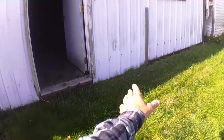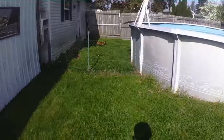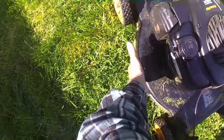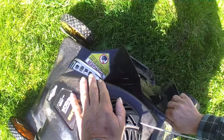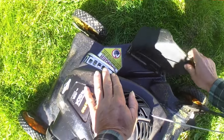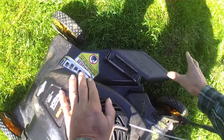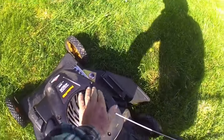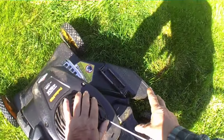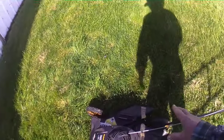Okay, now we're going to start the mower. Always start at the far edge, making one trip throwing the grass inward. This side of the mower is smooth, and this other side has the discharge flap. A lot of people like to put the flap up so the grass flies out better. This morning the grass is wet, so that might be the thing to do, but for safety reasons you should leave that down.